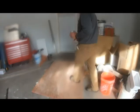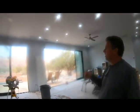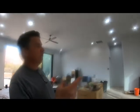In the garage, we're going to do a wheelchair ramp so the floor gets tiled and it'll be a ramp going down — if somebody needs access with a walker or wheelchair, it'll be a lot easier. The lighting layout was designed by Anna and turned out really well. There are 82 to 86 lights now — all on dimmers for balanced light all the way around. They're all LED so they don't use much energy and don't create any heat.